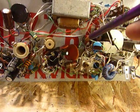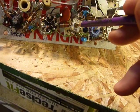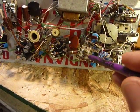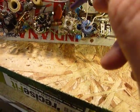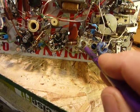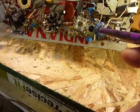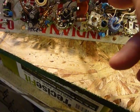Here's one of the little miniature toggle switches for changing the band. This is for 80 meters — this trimmer capacitor is for 80 meters and I cut that into the circuit with the switch right here. There's a lead going from there to the switch, and it just connects that capacitor to ground, which lowers the frequency of the tank coil for 80 meters. I used various capacitors I had on hand — a 0.1 and a smaller one — I just used what I got.